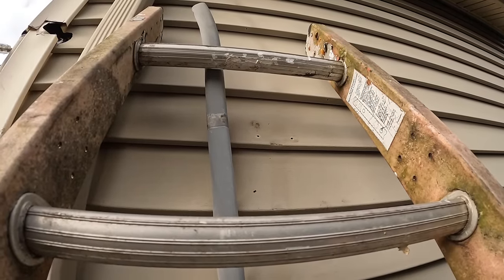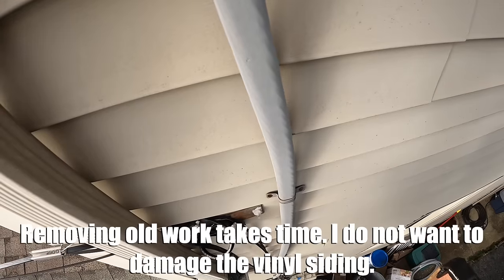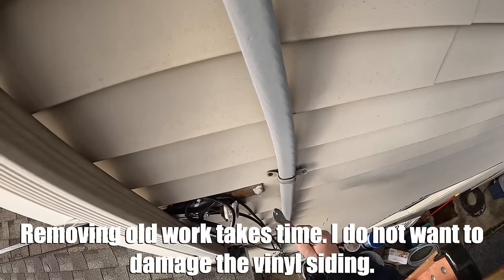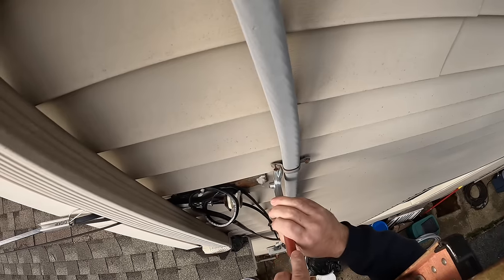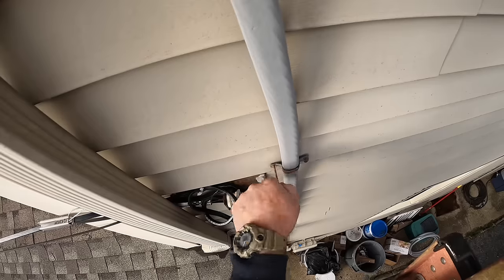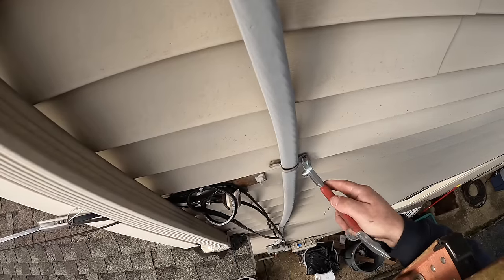This is also not uncommon when the siding is done, to not call an electrician to put the straps back in, but to use the siding guy to just take care of it. And a lot of times, as you've seen in my earlier videos, the meter pan's usually not even screwed back to the sheathing on the house. It's just usually flapping there in the breeze. Obviously, this wasn't an electrician that attached these service entrance straps, because electricians don't use nails to do this job, okay? An electrician might use a corrosion-resistant coarse screw like you see me using, or they'll use stainless steel.